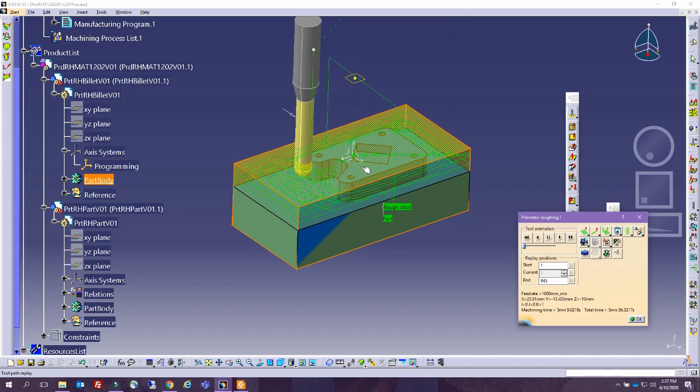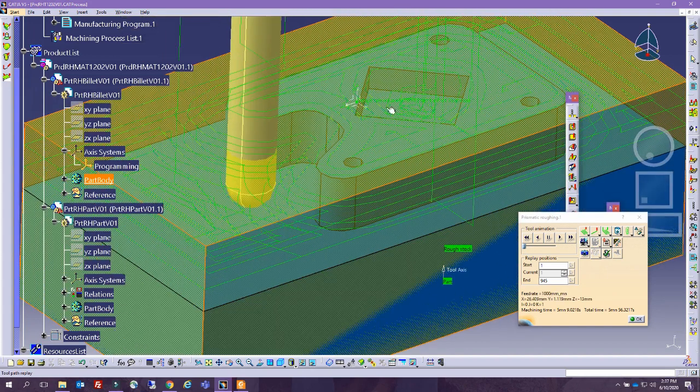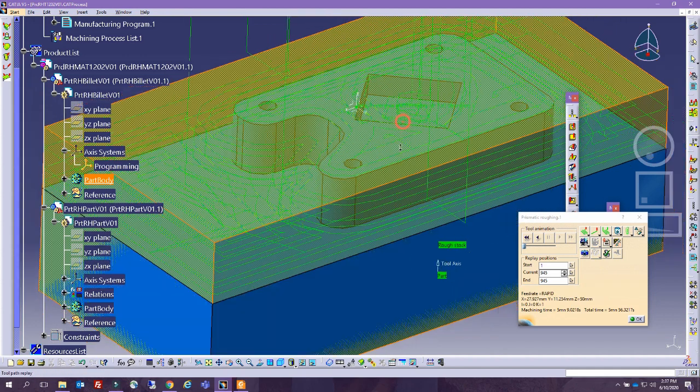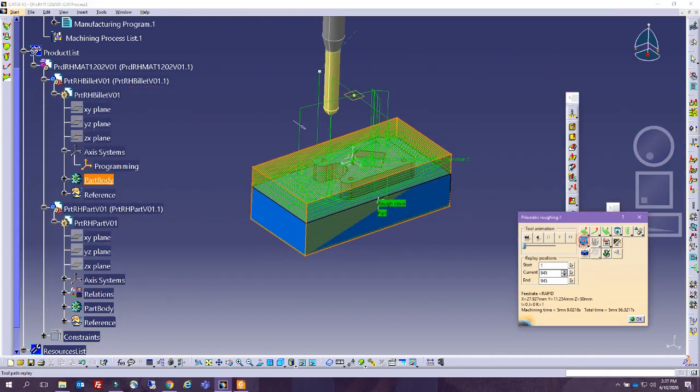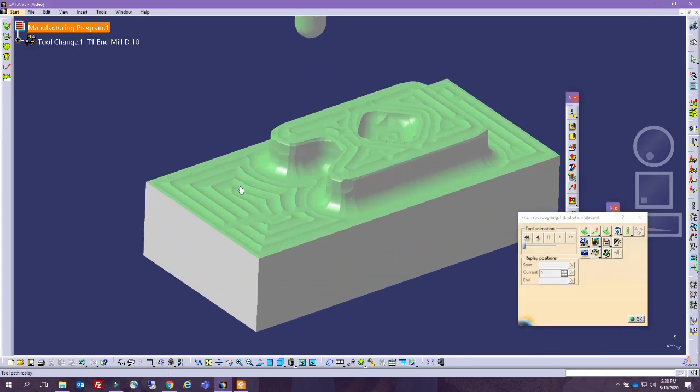So as you can see, it skipped completely the stage. It is now coming back to it, and it is creating those motions to the best possible. And you're going to see that the quality of manufacturing, so these are different levels, by the way, is not optimal. Let's see a simulation of how it is expected to look like. And that's totally normal because, first of all, we're doing a roughing. We're not doing a finishing stage. I mean, look at these dimensions, look at these scallops in here.